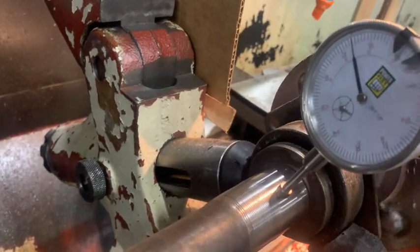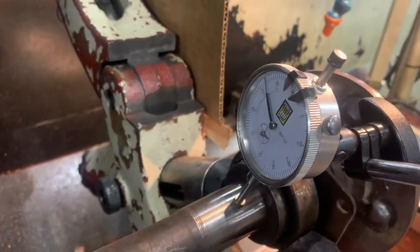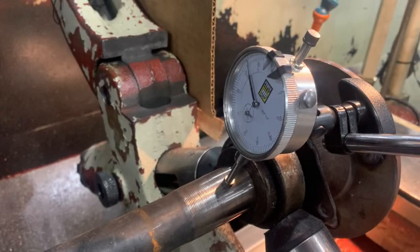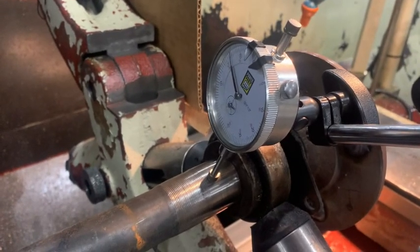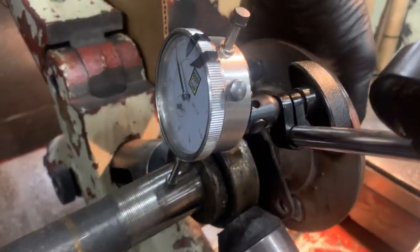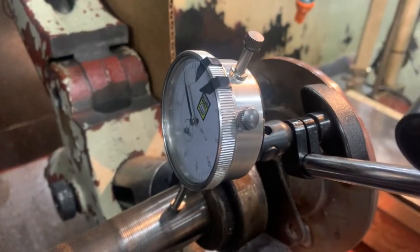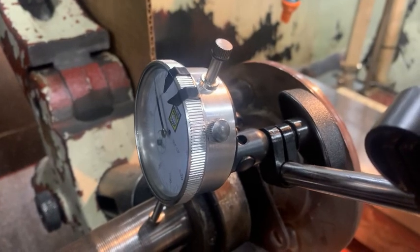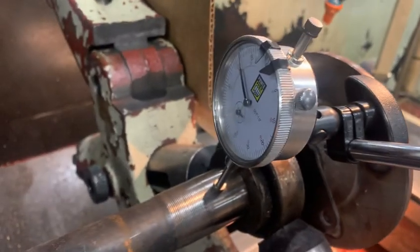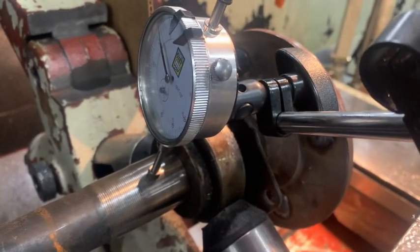Generally we do these on the bearings, that way it's going to ride in that rear end housing and everything runs true. I'm on the seal area — I just give it a quick polish and it's within probably half a thou. We're just holding the steady rest to hold the bearing in place. I just pop the center in. You can run into issues if the axle's ever tagged a curb badly. I'll chuck the spigot from this side and face the backside — it's got a fairly big rad, probably about three-eighths. I'll cover the bearing so we don't have to worry about chips getting in there. I don't know if he's reusing the bearings; if people don't tell me, I err on the side of caution.